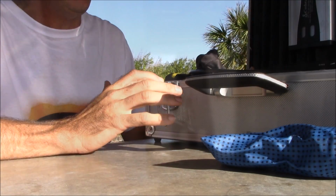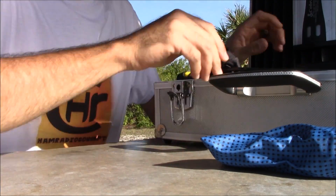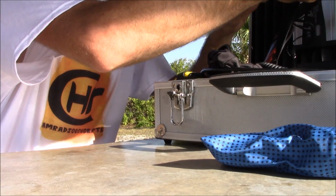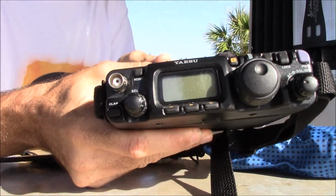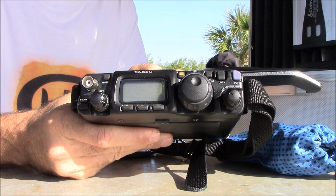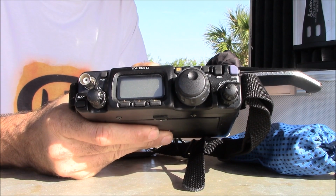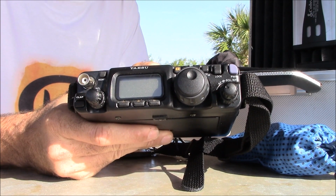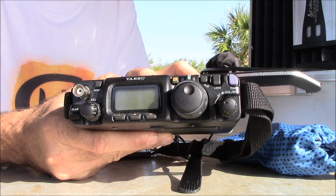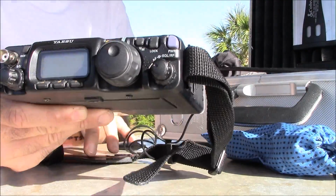Okay, so a lot of this stuff I have videos on already on my YouTube. Starting with the radio, what kind of HF radio do I have in here? I have the FT-817, not the ND model, 5-watt QRP, everything from 160 meters through UHF, all mode: sideband, AM, FM, CW, even digital packet. Battery powered with the battery pack inside here, and we'll show you how else I connect it.